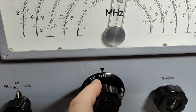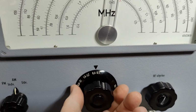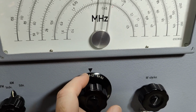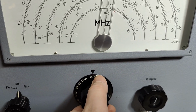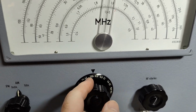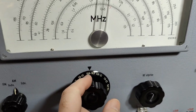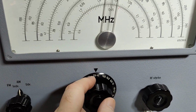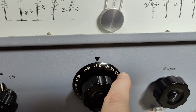This is of course a normal IF frequency because 455 kilohertz is here. And then this is one of the HF bands. So you need to have the 1.8 megahertz. And you also need to have this HF band. And then 10.7 megahertz is a very known IF frequency. Then again, very good HF bands. But again here, now there's an overlap, see?